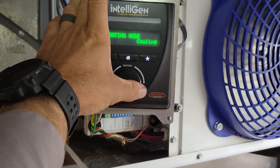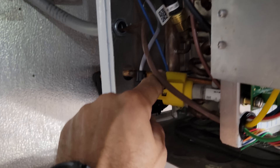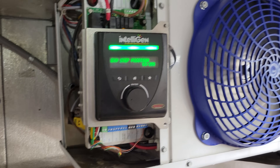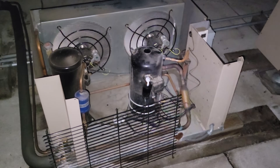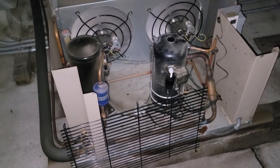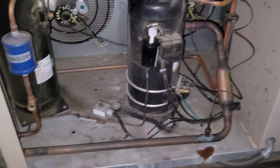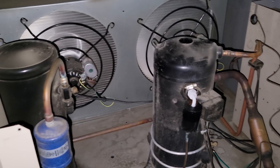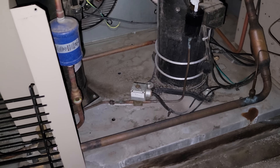It sounds like it just turned on — cooling. It just turned on right now. I wonder what caused it to ruin that transformer. I'm a little worried. I keep hearing a clicking sound from the back of the coil — the EXV. It just turned off and turned back on — it shouldn't be short cycling. We're running a clear sight glass, but the suction line is not very cold at all. I wonder if there's a problem with that expansion valve or EEV. Yeah, we're running really high discharge. We're not getting cold suction gas coming back — but let's give it some time and see if it stabilizes.